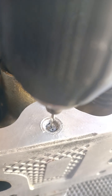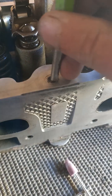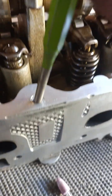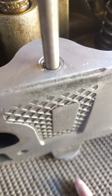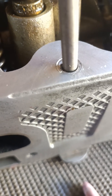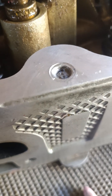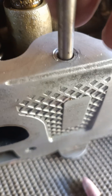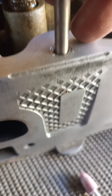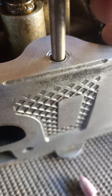If I flatten it down and get rid of those dimples, I'd be doing myself a favor. I found a larger punch that fits right in there. If I could get those dimples out and start again it might help me. It's hard metal, so maybe if I could heat this up I could hammer it down and flatten it a lot better than with the metal being cold. So I'm going to heat it up a little bit.